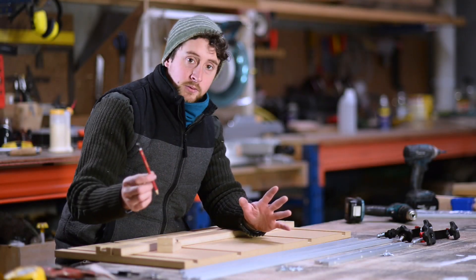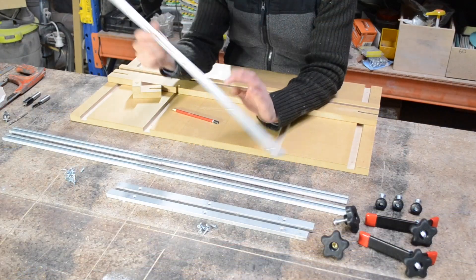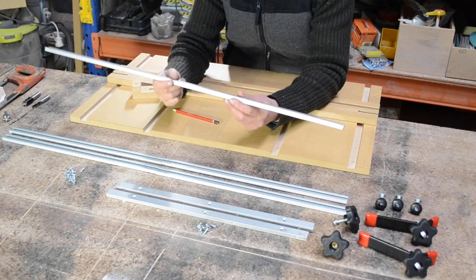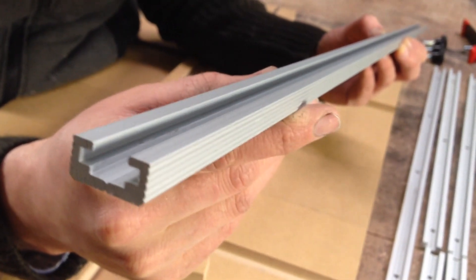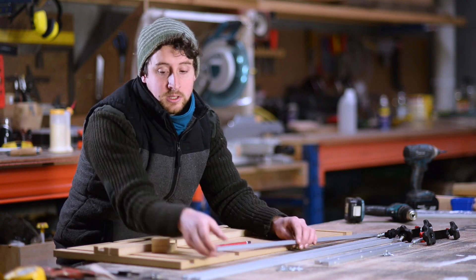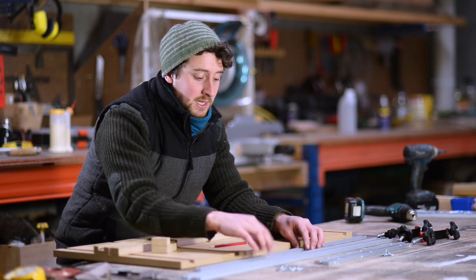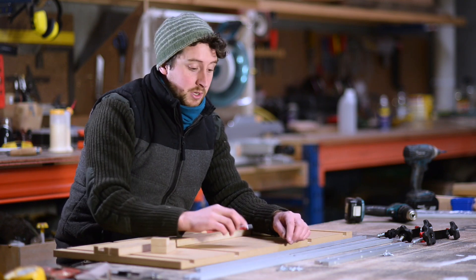When you open up your kit you've got a few things in front of you. You will have three full-length pieces of T-Track — these are 914 mils long. You're going to have to cut them down, and you can just do that with a standard hacksaw, then give the ends you've cut a little sand with a scrap of sandpaper to clean them up. It's pretty easy to cut through these; it's just aluminium so it's pretty soft.